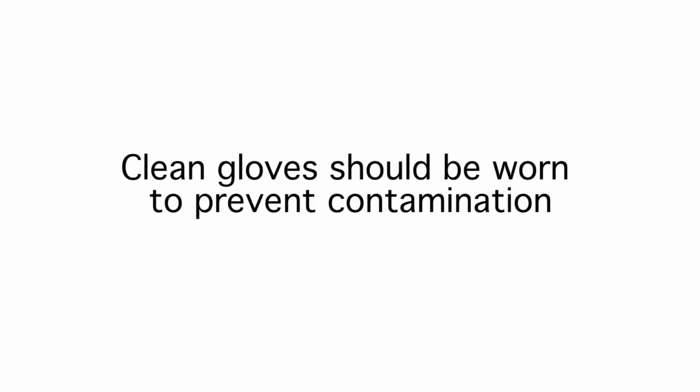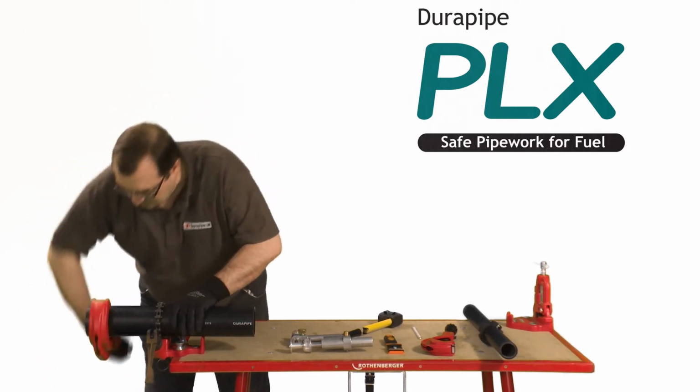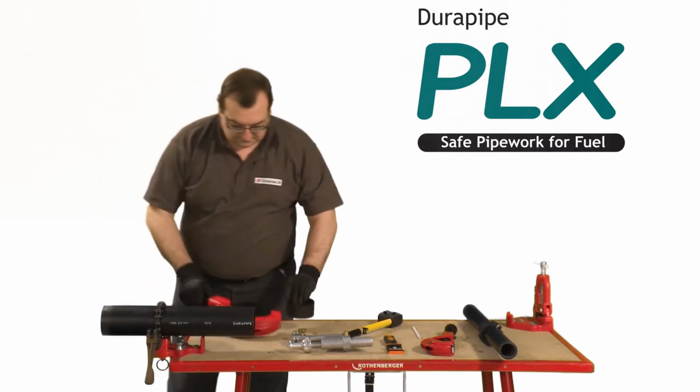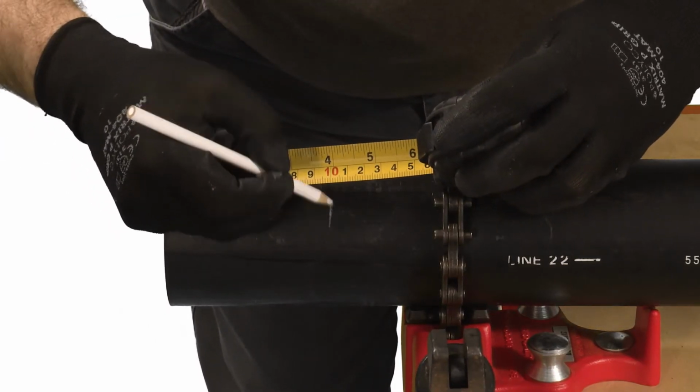Clean gloves should be worn to prevent contamination. It's important to make sure the pipe is cut clean and square. A wheel cutter is best suited for this job. The use of a wheel cutter ensures a square cut and swarf-free pipe. Mark the secondary pipe at approximately 100 mm.